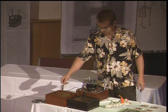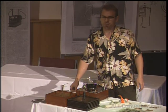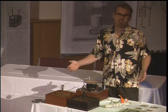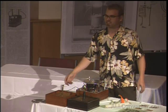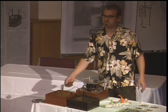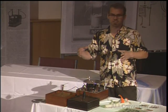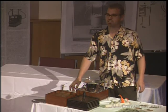In all cases, it's insulated heavily with this wax and rosin. The only other method is oil. Wax is the best system to use because you can keep it liquid a long time. Today there's resins and things that you can mix up, but normally the cure time on them is pretty quick. And with this type of system, I melt the wax and rosin by induction, throw it in the coil, and then keep it hot for a few hours to get all the air out. Any amount of air in these coils will destroy them instantly.